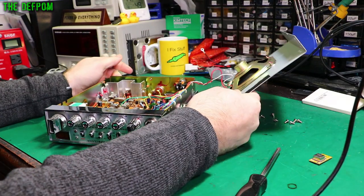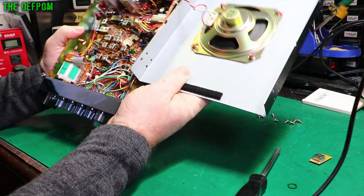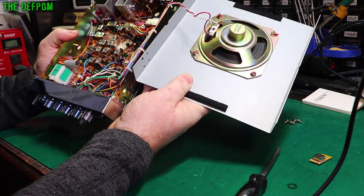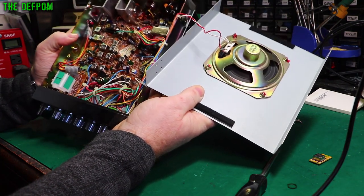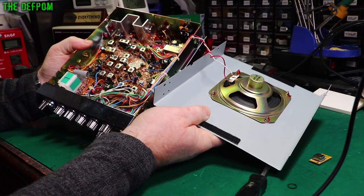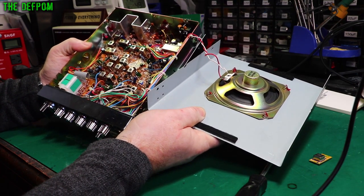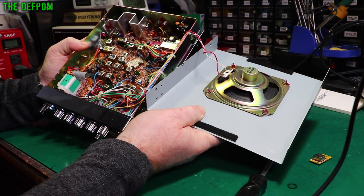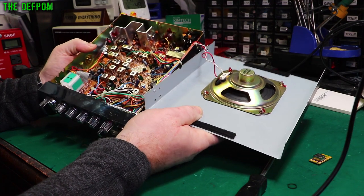Pretty much what we expect. Any signs of tampering — there's a diode intact, so it's looking like it's been left alone and no one's been messing with it. Sometimes the diodes in these things get cut to improve the AMC and get more modulation. It doesn't really work that well, but we'll see how this thing goes.